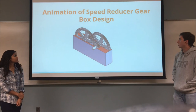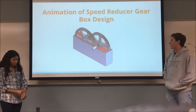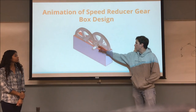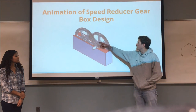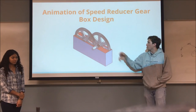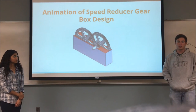This is a brief animation of our gearbox spinning. It starts at a very high RPM and slows down so you can more easily see the speed difference between the gears. The input gear spins extremely fast, and you can see the RPM difference between the second and output gear as it slows down — a total 22-to-1 reduction.